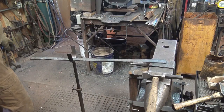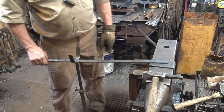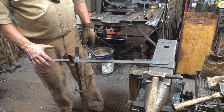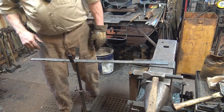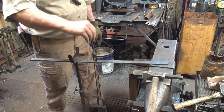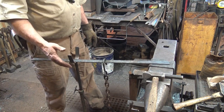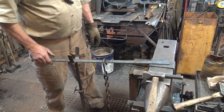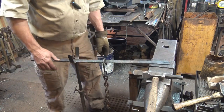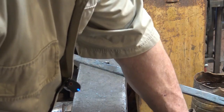There are other ways to hold work at the anvil. Using an adjustable work stand to set the work in is a help, although it can still be a little loose and floppy and might slide around. But it's way better than just trying to balance it on the anvil. To make this solution a lot better — and it's very simple — just get yourself a weight and hook system. This is just a big chunk of steel on a piece of chain, and now that's a lot more stable and adjustable to anything. You can use much longer bar, put it on any side of the anvil; it fits anything you're using.